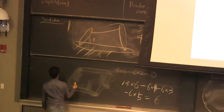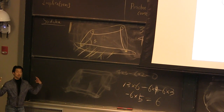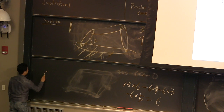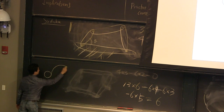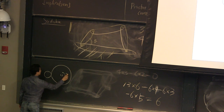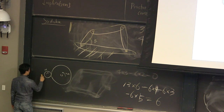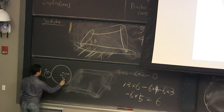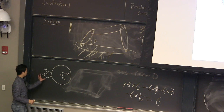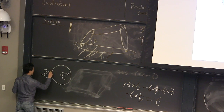You might just memorize that if you use a 2-to-1 gear reduction, you reduce speed by half and increase torque by 2, right? Imagine you have a pinion gear and then the next gear, and your shaft output is this, and this is the input, for example. And then it's torque 1 and then torque 2. You can draw a free body diagram, right? If this is a torque input, you can calculate how much force you're applying.